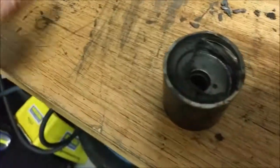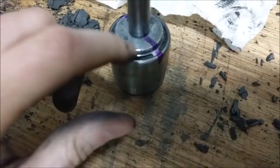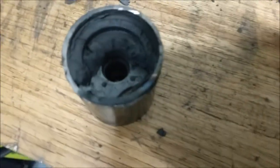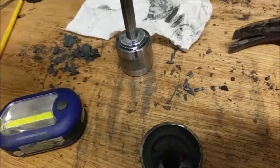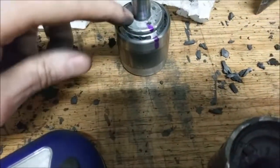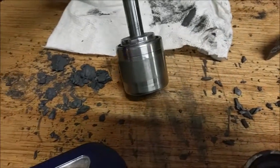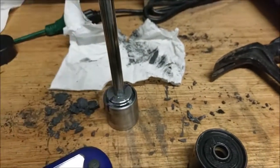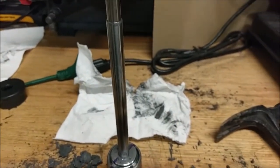When all the fluid leaked out, all these iron filings just turned into like clay — this stuff is like Play-Doh. And then it clogs up all your orifices. So now you're just packing this stuff down and it's just a piston slamming against this clay. At the bottom of this cylinder, this thing's loaded with a bunch of clay, so all you're doing is hitting clay up and down, packing it really tight. It seemed like it was offset to the side because of the way the load and stresses were going through.